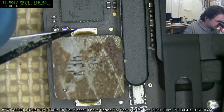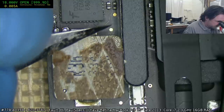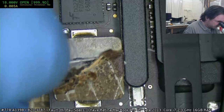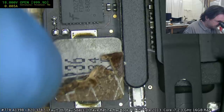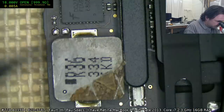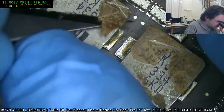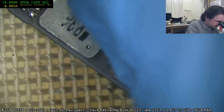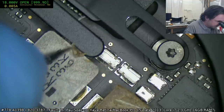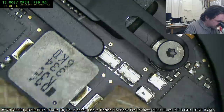Well, Mike Sims, I actually don't know for sure that this is going to be a problem fixed by changing the VRMs. However, almost inevitably the VRM should be changed on these boards anyway. But essentially what's happening is it bongs, but then it won't fully boot. Or you can get it to boot to a screen, but only if it's an external screen as opposed to an internal. And sometimes it works, sometimes it doesn't. So the intermittent nature of it makes me err towards it, and the fact that it's a known signature issue with these particular VRMs.